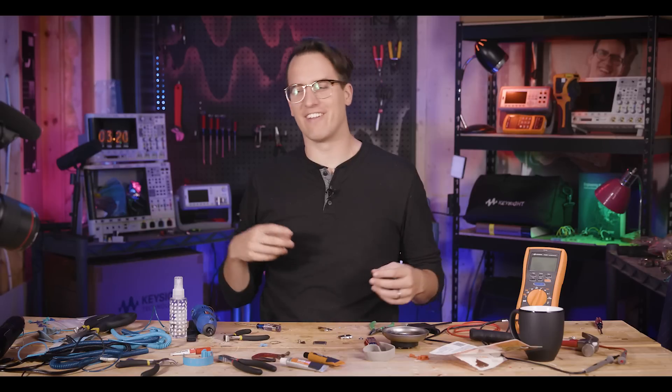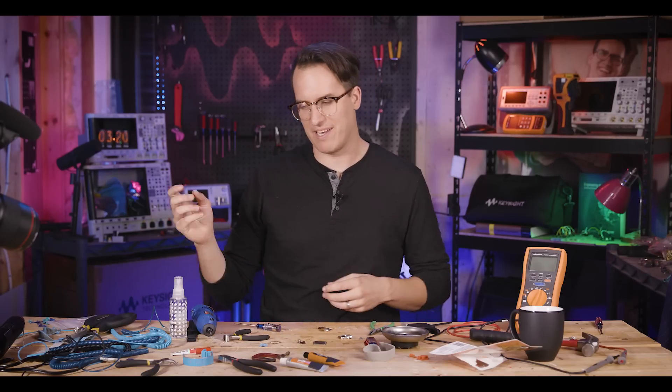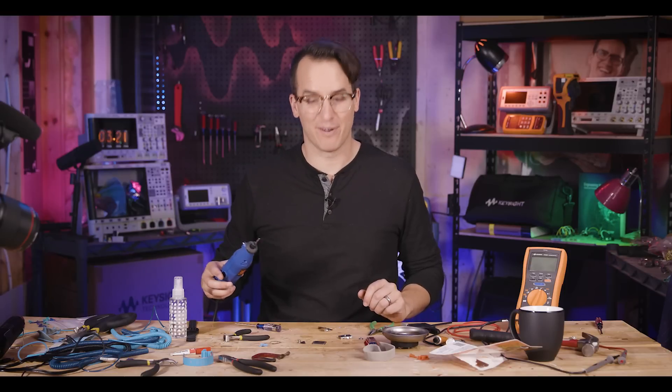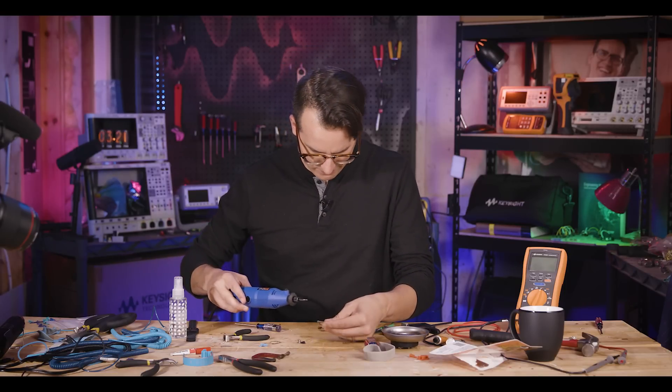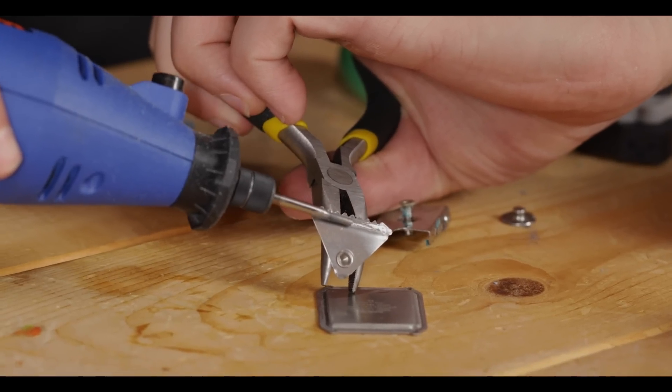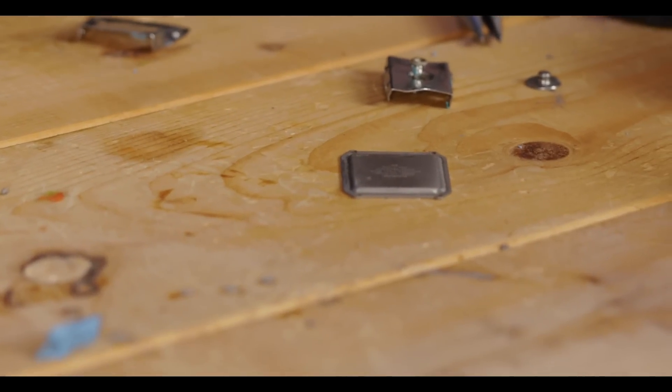After a fairly prolonged battle with the soldering iron, heat gun, flux, paste, and solder, it turns out it's really hard to solder stainless steel. So we are going to try an adhesive epoxy weld approach and see if that works. If it does, we can call it a victory and move on to our next build. The first thing we're going to do is scuff it up a little bit with our rotary tool. That should help it stick a little bit. And then we're going to read the directions on the glue.